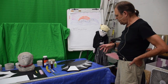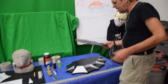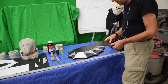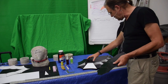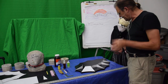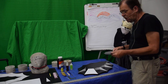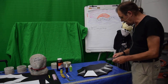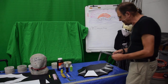I didn't show you the separation of the 2 pieces. But, you know, it's pretty routine. I just had rubber cement between these 2 pieces, and I separated it. And then you saw that I was scoring this. Well, as it turned out, all I had to do was score these, and that allowed me to just flex the styrene, because if you don't know, all you have to do is score styrene, and it will snap perfectly right on that line or curve or whatever you make. So I did that, and I got the bottom one and the top one.